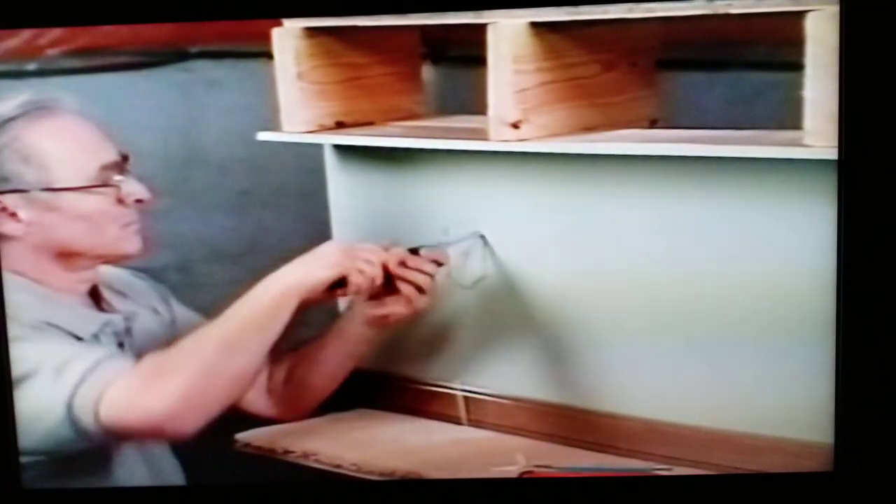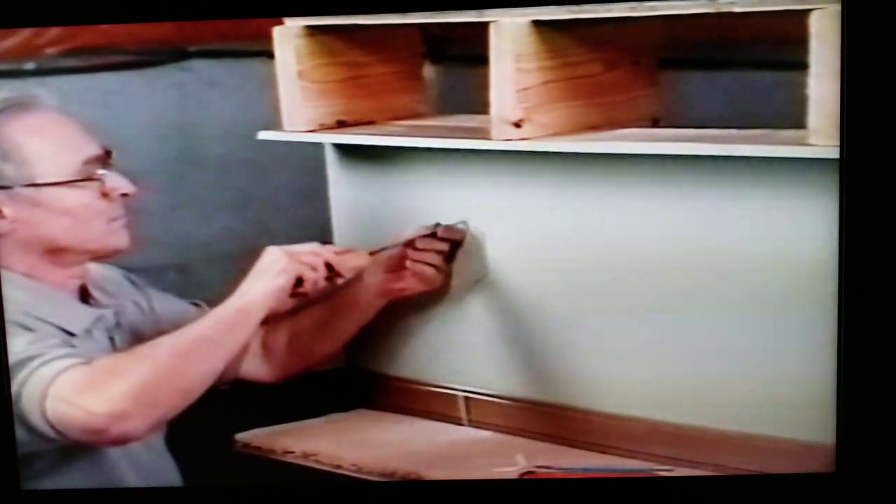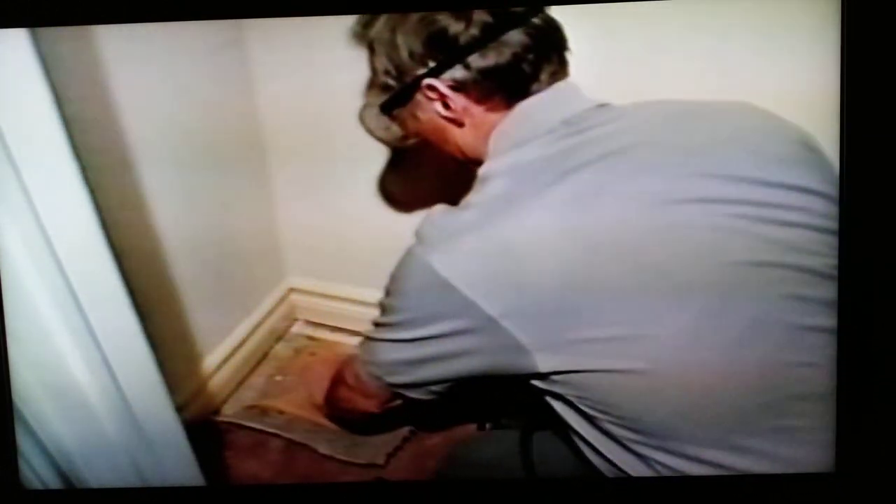Now check for inner wall obstructions by bending a piece of coat hanger at a two inch right angle, pushing it through the hole, and twirling it in the cavity. Drill a two and a half inch hole in the interior closet wall only. Make the hole in the exterior closet wall the same way as was done previously for normal inlet valve installations. From inside the closet, if carpeted, pull the carpet back. Drill a pilot hole as before and check for obstructions. If it's clear, drill a two and a half inch hole in the floor, then replace the carpet and cut a hole in it with a sharp wallboard knife. Run the low volt wire through the hole in the wall and down through the hole in the floor.